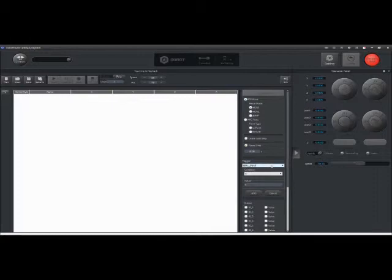Here you have regular triggers for inputs as well. You can have all these types of inputs for control. You can set conditions right here as well. You can set what values you want. If you move over to your right, you've got the speed. I can control how fast it moves. I control the suction, the laser. I control each individual joint, and it's just amazing.